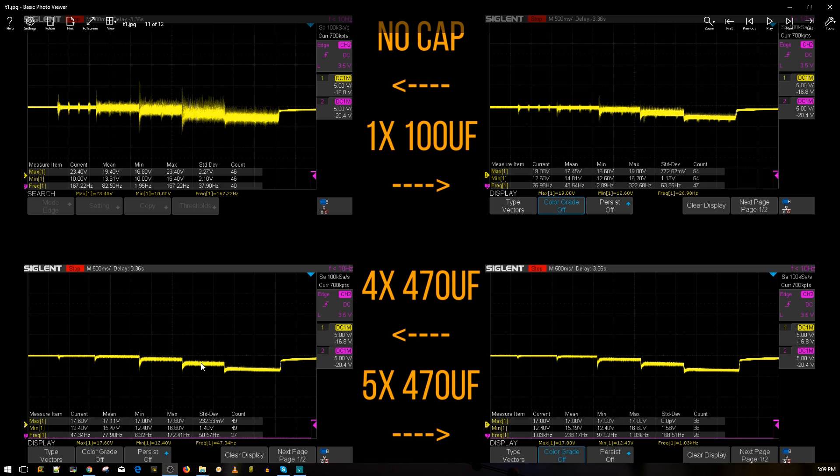Let's take a look at the voltage drops and voltage spikes. With four caps, we got a 17.6 volt spike, which is pretty crazy because the battery is 16.8 volts — so that's less than a volt of a voltage spike. That's incredible, I've never seen that. Without anything it was 23.3 volts, so it jumped up around 6 volts. With four low ESR capacitors it was not even 1 volt. And with the 1000 microfarad it jumped up around 2.2 volts — still pretty good for just one capacitor.